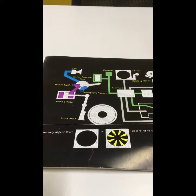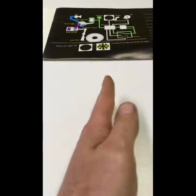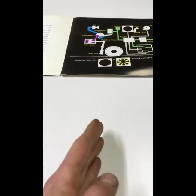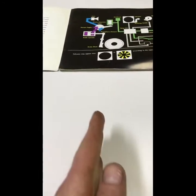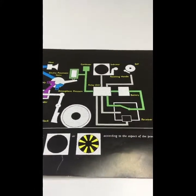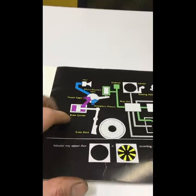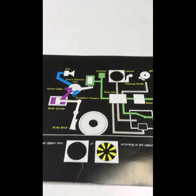The Great Western tried the ATC system, which was an electrical contact ramp in the track, and that was offset. So instead of having, as you would with AWS now, where it's perfectly in alignment in the middle of the track, the contact ramp was slightly offset — skewed, much the same way you have with the overheads — so as your train's ramp hits it, it's not wearing a permanent groove in one spot. It's evening out the wear and tear across the contact ramp. That was an electrical method where a battery lineside would supply a battery voltage to the contact ramp and into the contact from the locomotive. If the voltages were correct, the valves wouldn't lift. If the voltages were opposite, the valves would drop and put the brakes on — same way that the AWS works now.